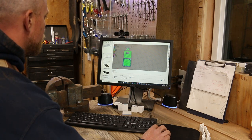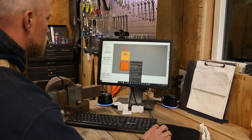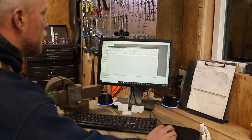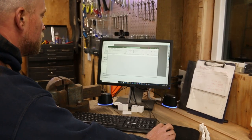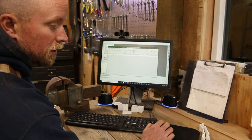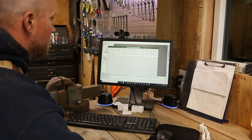Twenty hours — so I saved five hours, but I lose resolution. It's been great having this little settings file. I come in and as I figure out what works, what doesn't work, I keep track of it. I have all my basic settings in here. So if I go with a 0.6 millimeter nozzle, then I also need to change my layer height to match that.